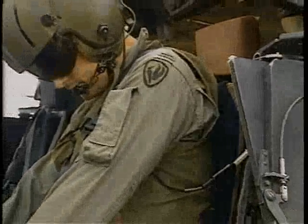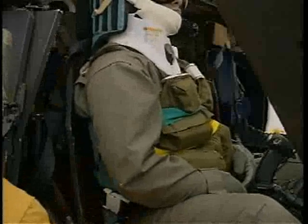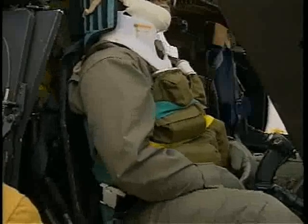To extricate the pilot, first disconnect his helmet cord by pulling the sections of the connector apart. Do not remove the pilot's helmet unless absolutely necessary. Next, remove his seat belt by pulling the lever. Remove the belts and set them aside so they won't get in your way. Ensure that the pilot's feet are free from the tail rotor pedal's rough edges or metal that may have been torn during the crash. Once the pilot's feet are clear, he can be removed and taken to the staging area for medical attention. If backboards and extrication devices are used, more working room can be gained by tilting back the pilot seats and exiting through the cabin.